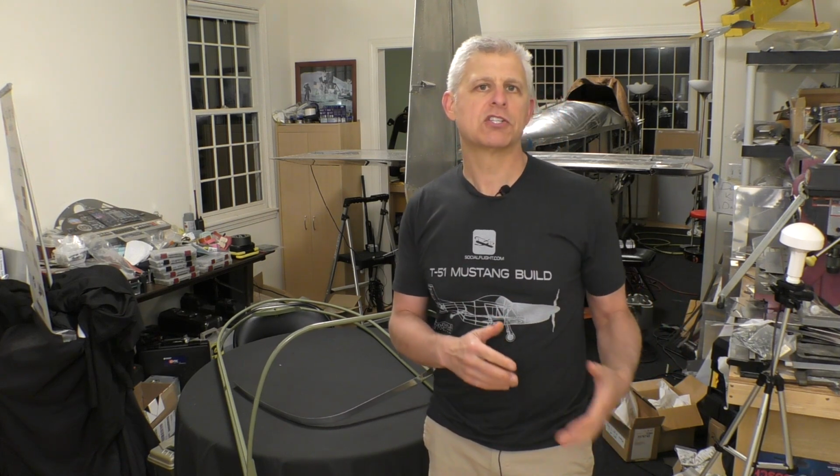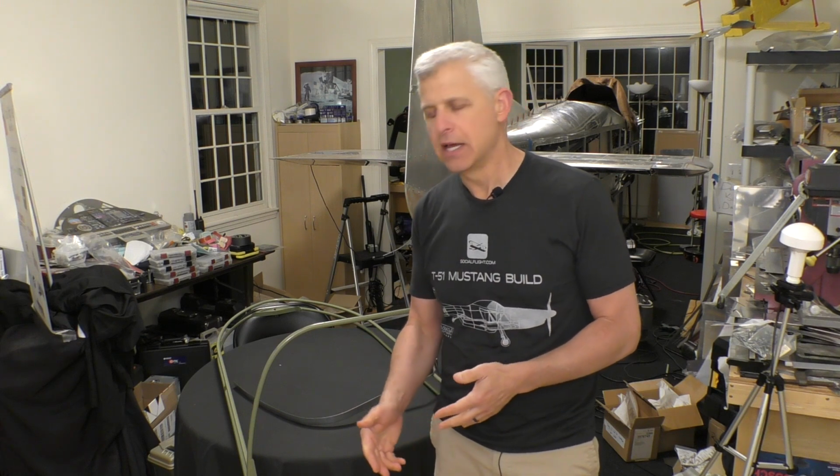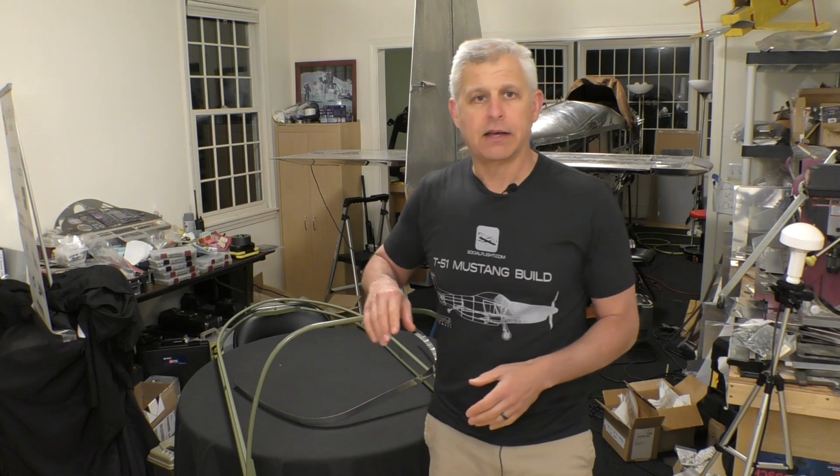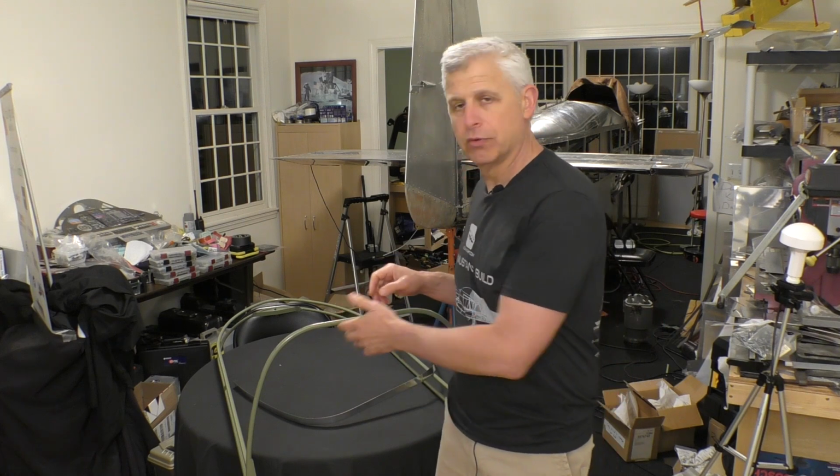Basically, when you are mating materials where one is much softer than the other, and in this case, we're talking about plexiglass and steel and aluminum, we're going to want to drill the aluminum first, have all of the holes in that. And only after that can we go through and match drill to the plexi, because we want to go in very carefully through that just to match it.